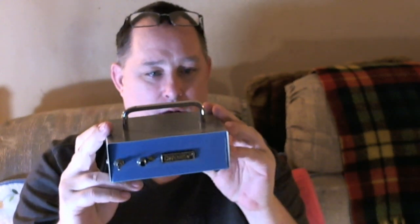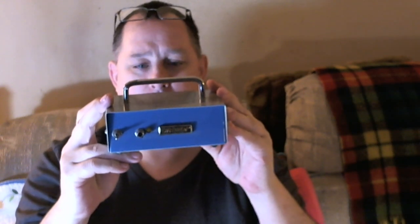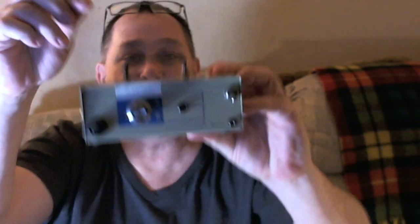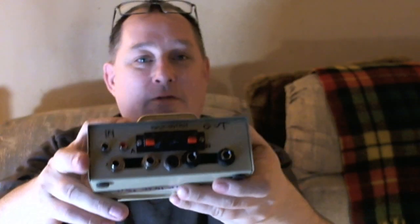So yeah, this one, TPA3118, 60 watt mono. So yeah, this is a mono amp, but this is just showing you these chassis, how I've used them. This is a 15 by 2. It's got a flip-up handle that every time I do a video of this, I can never get to flip up. But this is one of my favorites, the 15 by 2. It'll run off any 12 volt power supply, 12 volt, 500 milliamp, up to 3 or 5 amps, whatever you got.